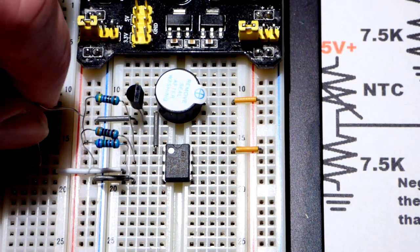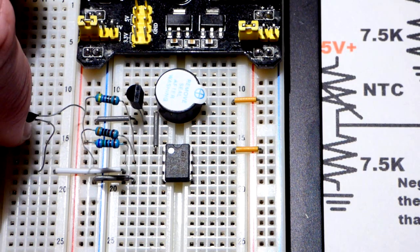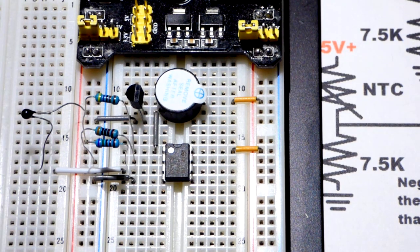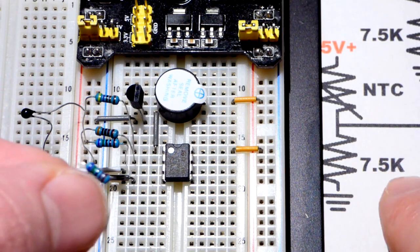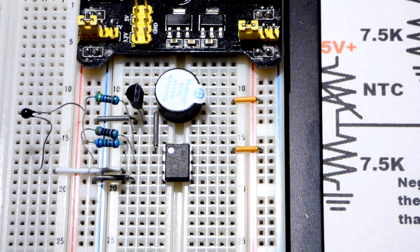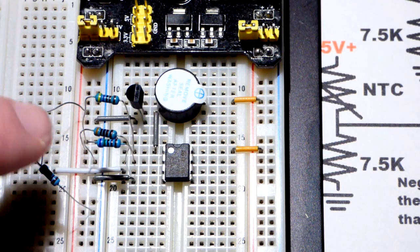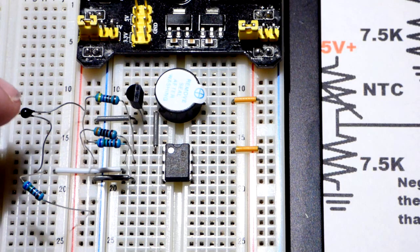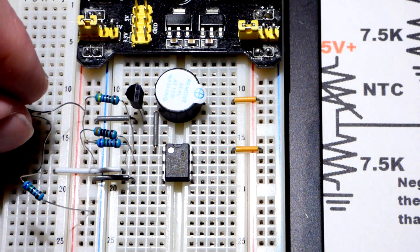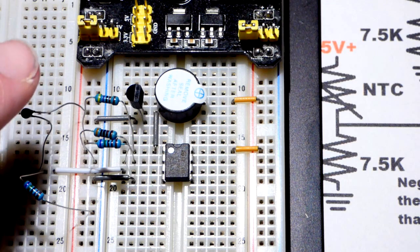There's a jumper that goes to pin three — the second to bottom pin. The little ball on the thermistor is off to the side so I can set the resistor right up against it so it'll always be in contact. In a practical circuit I would affix it to the resistor, but this is just a prototype. We're using a 7.5 kilohm resistor on the negative side to form the voltage divider. So we have a voltage that's varying based on how warm the resistor is.